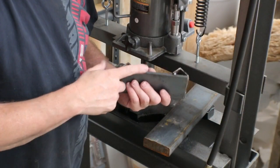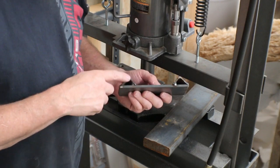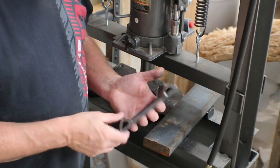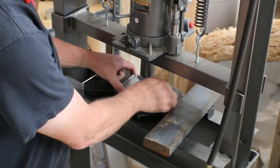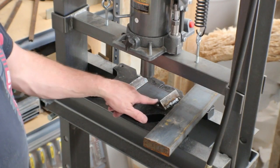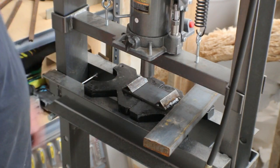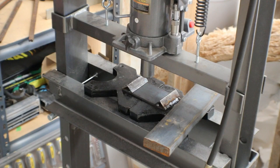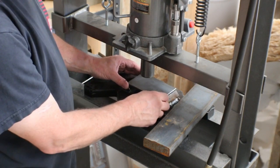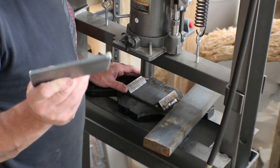Okay, so what I've made here is just a piece of 1/4-inch plate with two pieces of, I think that's 1-inch angle iron. It's tacked on the inside, and the distance there is about 3.5 inches between the two angle iron, and it works by putting this piece that we want to bend, which is just another piece of 1/4-inch,